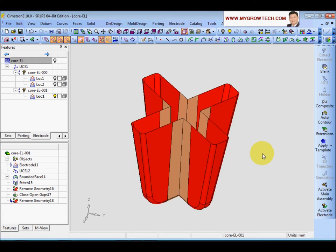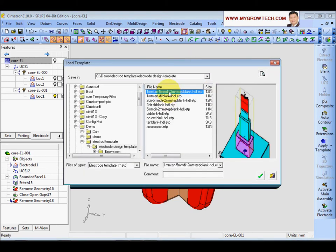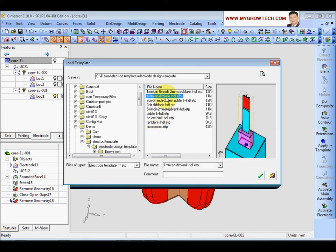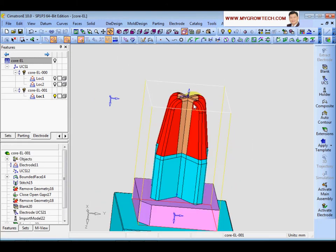For the next stage — how to create a blank, UCS and things like that — I can continue by using a template. From here I can choose 'from template' and select which template I want. The electrode is now done. Due to the template, the electrode has a standard color code. You need to assign the correct surface colors — the extension surface and the red surface, which is the cavity surface or part surface. This color coding is important to identify the area that needs to be machined and must obtain very good finishing.